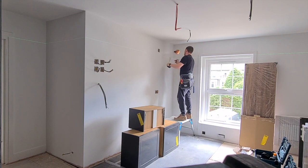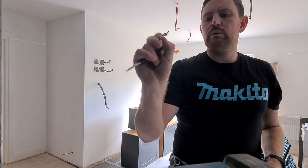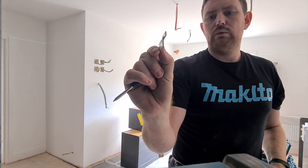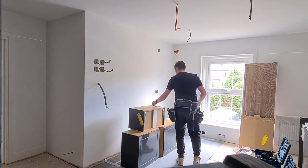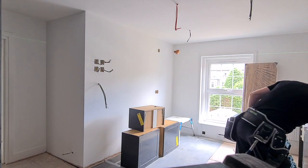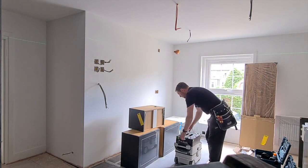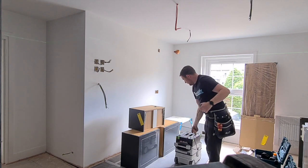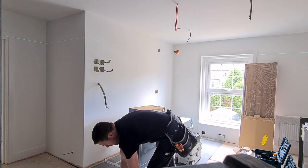This next little clip coming up, I'm just showing you the bracket up close to the camera. It's like a little hook, if you can see that properly. And then them tiny little clips on the back of the cabinet there, just hook over them, and that's what lets you then adjust it, pull it back to the wall nice and tight, and job's a good one.